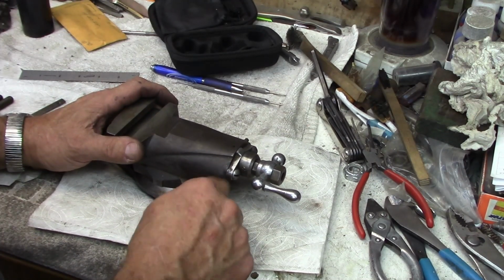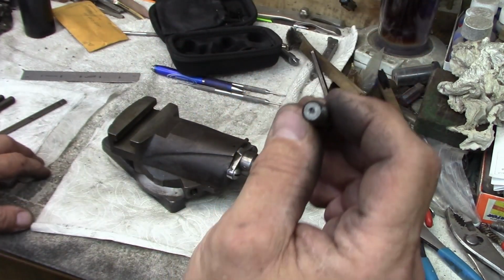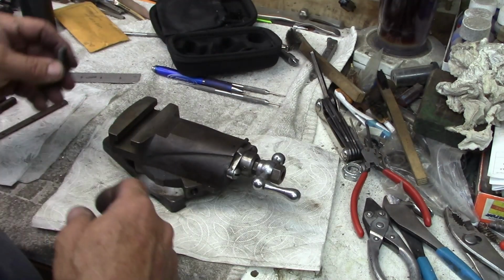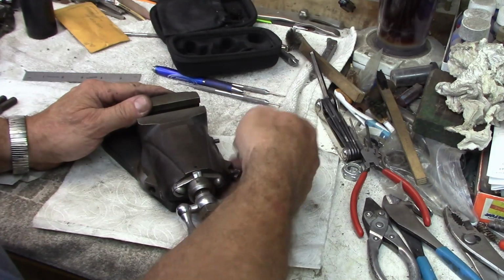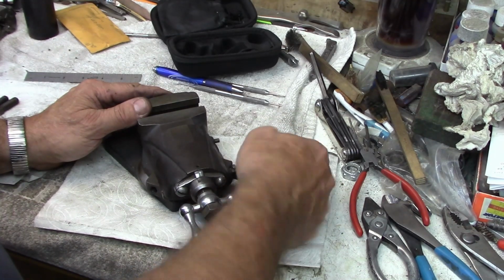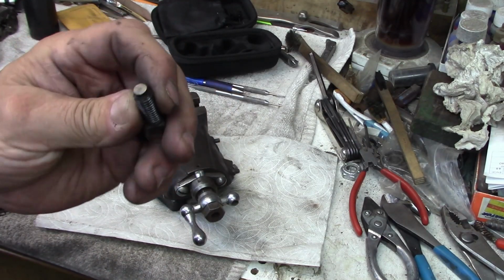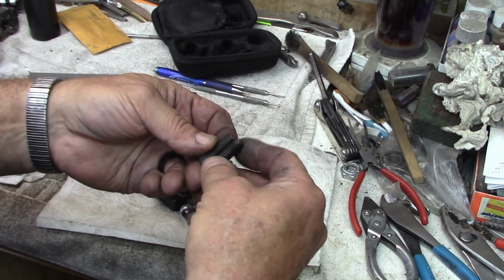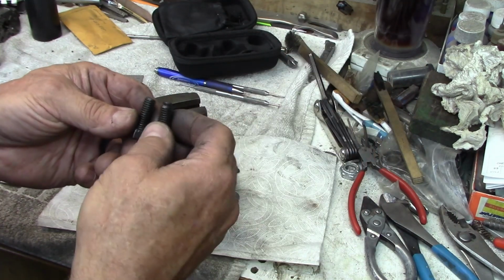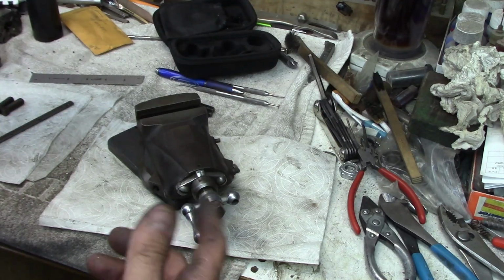And all these is, like I say, our standard 3/16, and that one looks like it's been flattened out there. You see a little bit of the nubbin in the center, but it's been flattened on the end. So that may be what's in both sides of these. So when you loosen those, now this one does have a little bit of a dog point on it, but like I say, it's flat on the end. So for these, it doesn't make a bit of difference. Yeah, and this one's a little bit longer with that dog point. So whether this was an original one, whether it's something somebody else came up with, shortened up and put in there, I don't know. But nonetheless, that's all this stuff's been changed over the years.